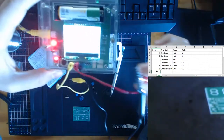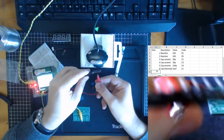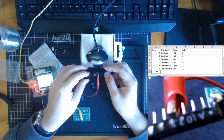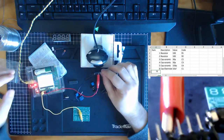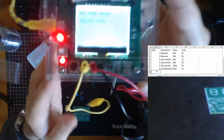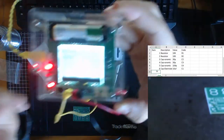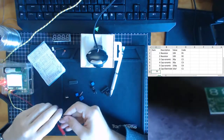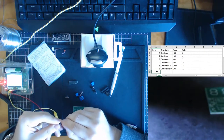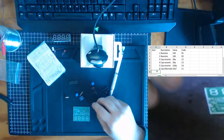Oh, I see the problem. So yes, this is the component over here. Plugging it up, sorry. So here we plug a component up to this point over there. That's fine. The issue is I was touching two pieces, and once I touch two of those pieces, it stops being a single resistor, and it's like having two resistors in parallel, which is why the resistance was halved. But if we just plug it into one, we see, yeah, they're all 1,000. Oh no, I've bent it. Cool. So these are all 1K resistors.